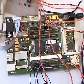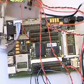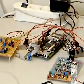The first component is the Triton Development Kit. It consists of an X-scale processor, the PXA270, and it functions as the central nervous system of our RFID Guardian. It has the microprocessor, it has all of the memory and flash memory, and basically it holds the entire system together. The rest of the RFID Guardian consists of analog electronics.